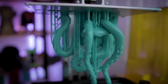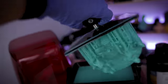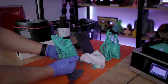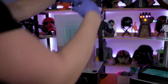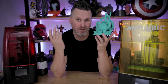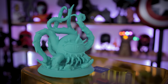Eight and a half hours later and our prints are complete using the Mach 5 screen protectors on the Elegoo Mars 3 as well as the Anycubic Mono X. I've changed none of my resin 3D printer settings in order to work with these. Some people recommend upping the power wattage on the Mono X and mention having to adjust exposure settings slightly, but I have not touched mine whatsoever, and the prints look fantastic. Here's our print cleaned and cured — printed on the Mars 3 and the Mono X using the Mach 5 screen protectors. This file is created by Chibi STL. I did the two-part option, supported it, and printed it at the default scale on both machines.